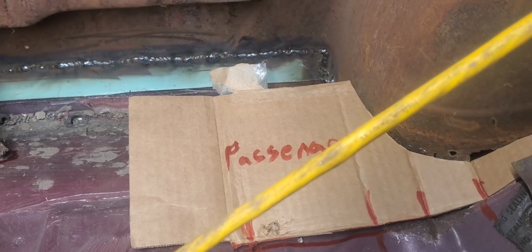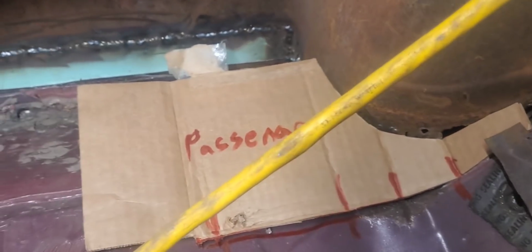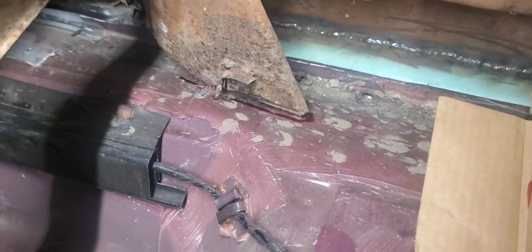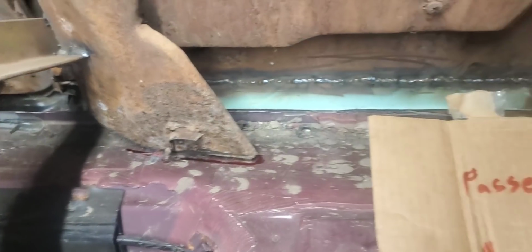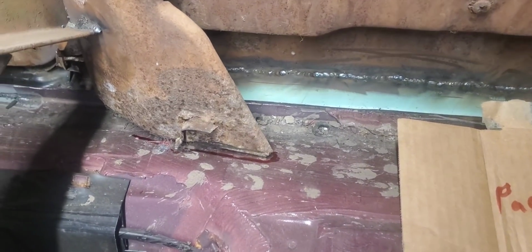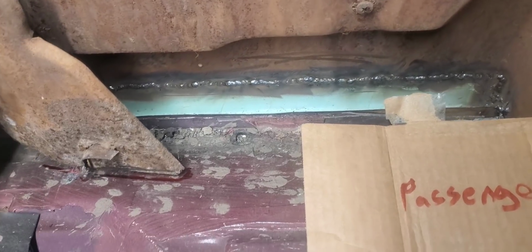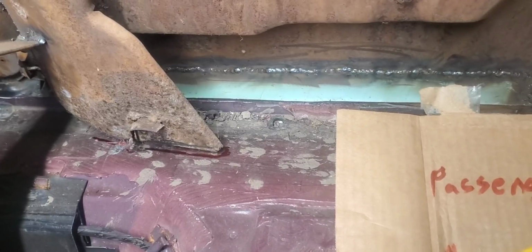All right, we went ahead and mirrored that driver's side one. Went ahead and set one over here for the passenger side so I can mark it exactly where it goes. And we did the same on the driver's. And we went ahead and found a couple more reference points just randomly throughout this whole thing. That way, once we get her lifted off of here and go back down with it, we'll be able to set it down in this exact spot and get her welded on there completely. So we'll go ahead and get her in position here and start lifting it off.